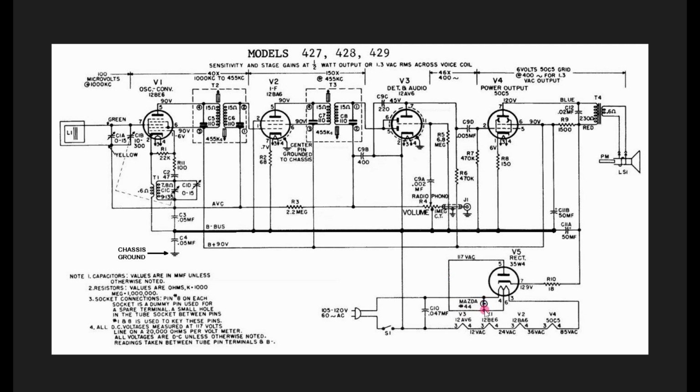This is the little 44 2-watt lamp. As you're lighting up the filament, it goes through and it lights them like this, and that's where the current is across part of the filament, and we will add a resistor there. So here you can see that I've got the Y2 capacitor for C4, the X2 capacitor across the line as a filter, and I've added a 68 ohm resistor across the lamp, and I'm using a type 47. So a type 47 instead of a 44. It's a 150 milliamp 6.3 volt lamp.